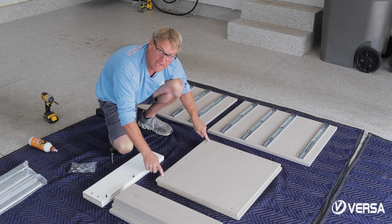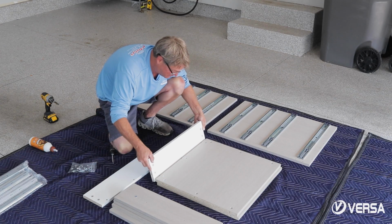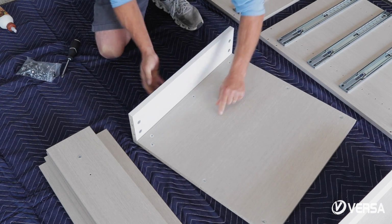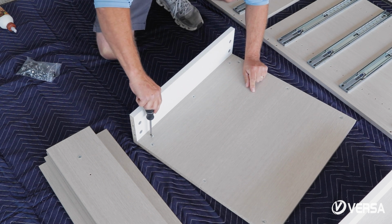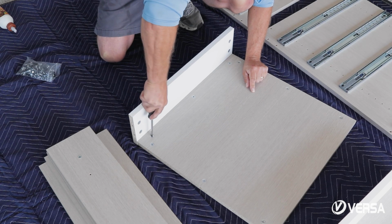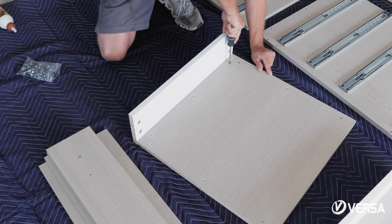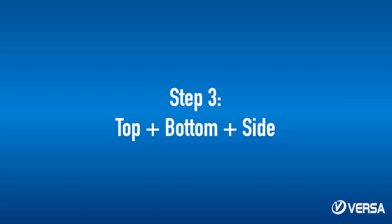That is the back of the cabinet. So that's where we're going to mount. We're just going to slide them into the cam holes. And this is where our number 2 screwdriver comes into play. When you turn, you get fully around and then a little bit extra, and it pulls it together for a very tight grip.